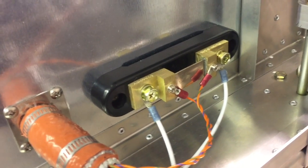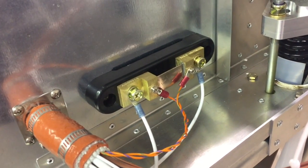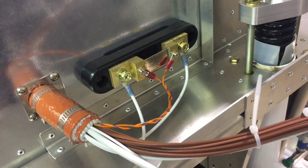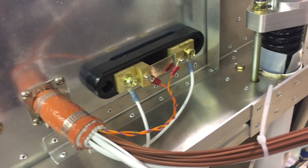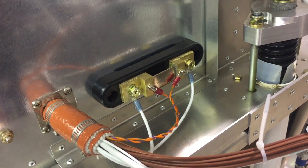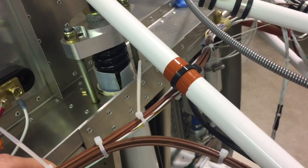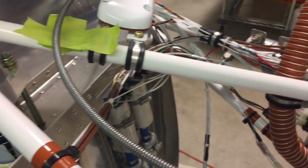This is a 60-amp shunt that comes with the Dynon equipment, and it's kind of optional — even Dynon says it's optional. The shunt is used for the ammeter to measure either the draw on the battery or the output of the regulator or rectifier, depending on where you hook it up. I had it, so I installed it, but you can just use a voltmeter if you want to see if the battery is charging or discharging. There are some other wires here — mostly ground wires or power wires to the oil temperature, oil pressure sensor, and fuel pressure sensor that run along this side.